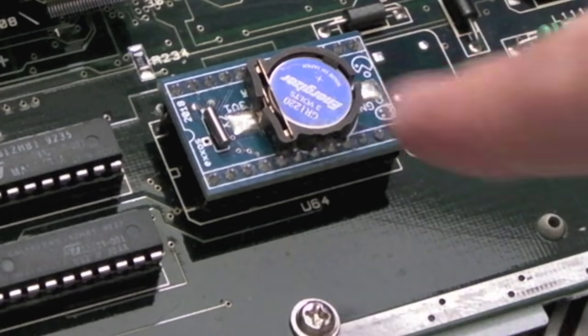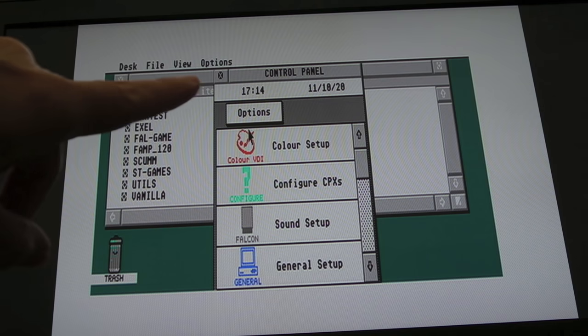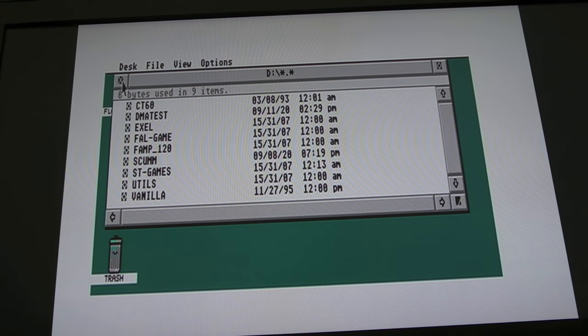The battery arrived — I've fitted that on the real-time clock chip. Filming this bit right at the very end just to show you the real-time clock is working. That is the date where I'm actually editing this part of the video — quarter past five, I've been editing since about lunchtime. Some of the footage when I installed the CT60E — once it first booted, you saw an exception. That was related to NVDI — or rather the blitter. The blitter is the problem with the CT60.